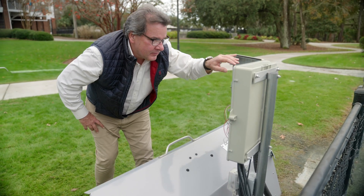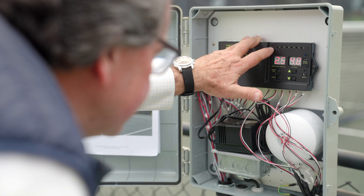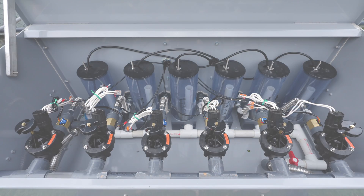The HIQ control panel is where the water level set points are stored, adjusted, and monitored. It is wired to the water sensor, the solenoid valve, and the flow meter for each cell.